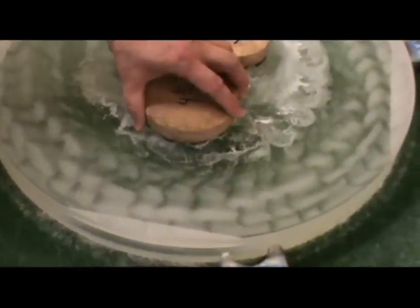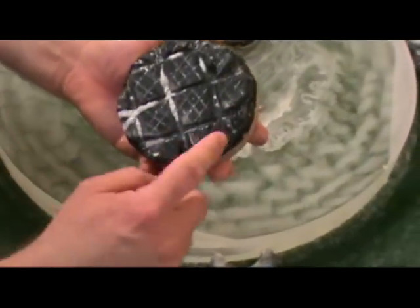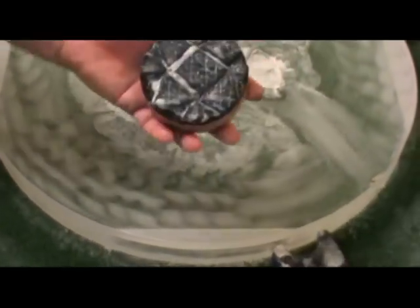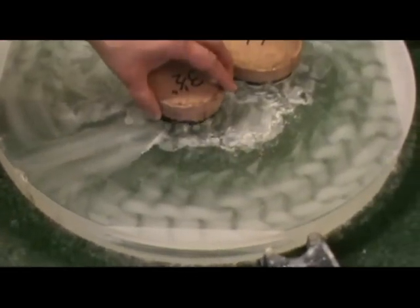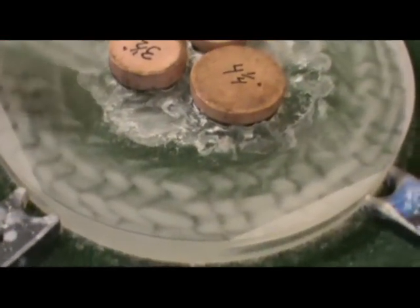If you look at the other pitch laps here, they're all starred like that more or less. This big one has big chunks taken out of it, as you can see. The three and a half inch lap is the same way — big pieces taken out of it. So that helps with blending to make sure that your action is smoothly carried out to either side.